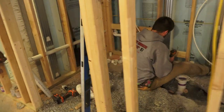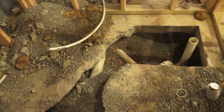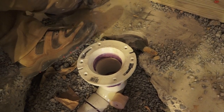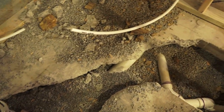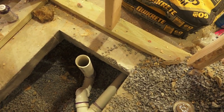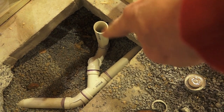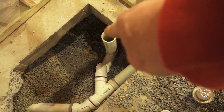We do have a five-foot shower going into this bathroom. Everything's jacked apart here — this was pre-existing plumbing but we had to move it. We had an existing toilet flange that we had to move a couple of inches, so we had to jack the floor open. Nine times out of ten we're jacking the floor open to find the existing plumbing the builder put in and moving things around. We're moving the drain and the two-inch P-trap that will be the drain line for our shower — we had to relocate that drain line opening based on our new shower pan.